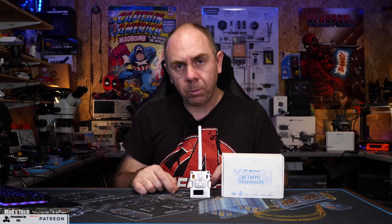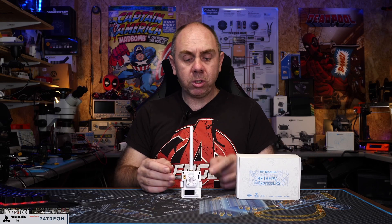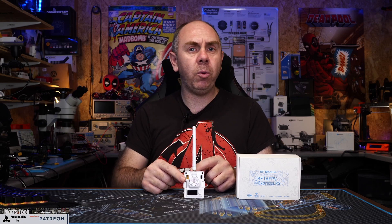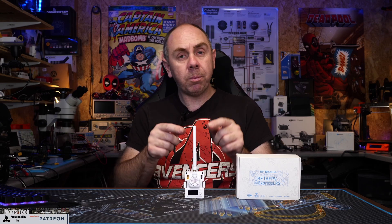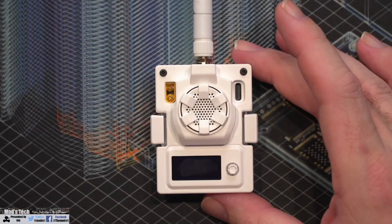It also has that party piece of a color-changing LED. The module itself is a JR-style module designed to go in any of the modern OpenTX radios including the T16S or anything that supports the Crossfire protocol. It supports USB-C for updating the firmware and up to 2S power input to allow you to power the module externally rather than drain the battery on your radio when using it on the high power settings.